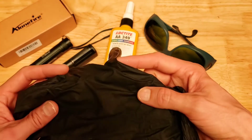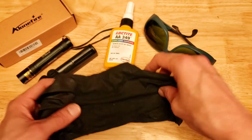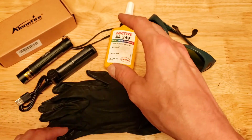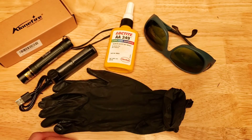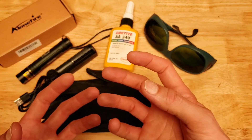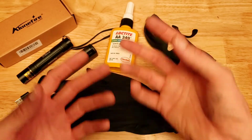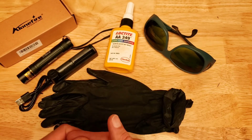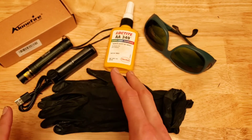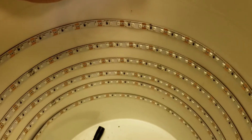Last but not least — gloves. You want to use gloves when handling this adhesive. You really don't want to be touching resins, polyurethanes, and epoxies with your bare hands, because your hands can develop a sensitivity to those things. You'll have allergies later if you handle them too much, so use rubber gloves at all times.